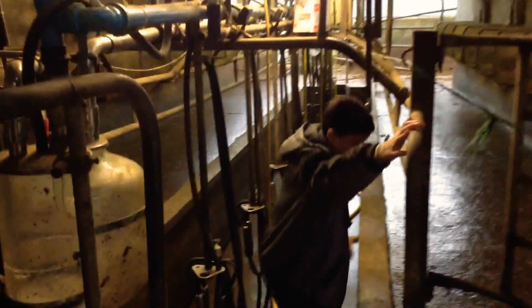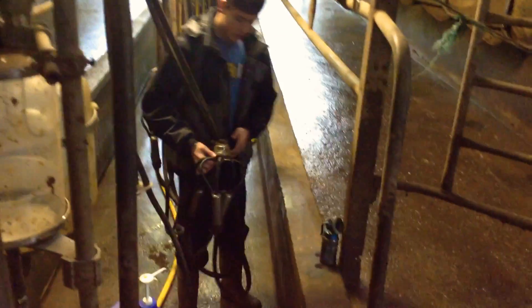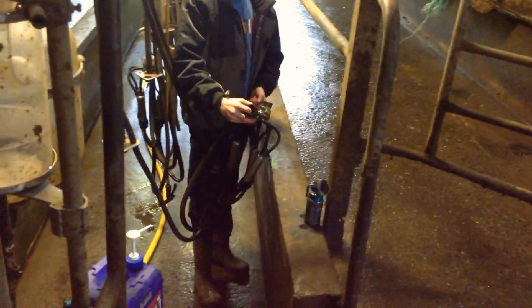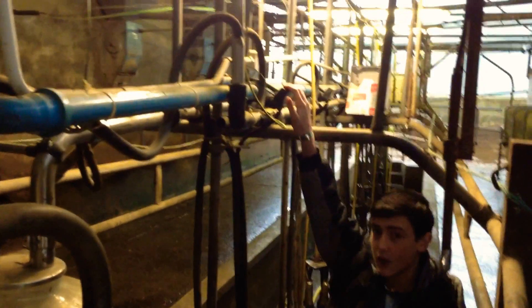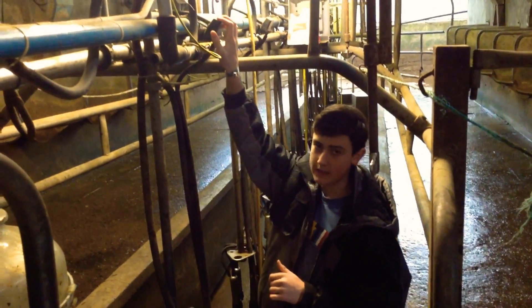When you're down here, the cows would come in here and the udder would be here. So you take this — this is called the cluster — and you'd put it on bit by bit. This bit here, the cow's teat, goes in there, and inside it pulses under suction, which brings the milk out of the udder into the milking parlour. And the pulse is provided by this thing here, which is called the pulsator, and this is one of the three super important things in the milking parlour.